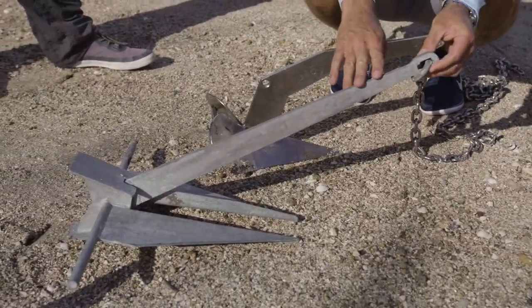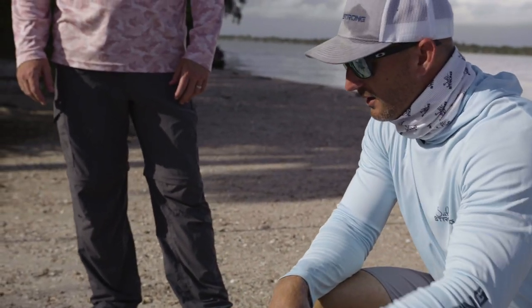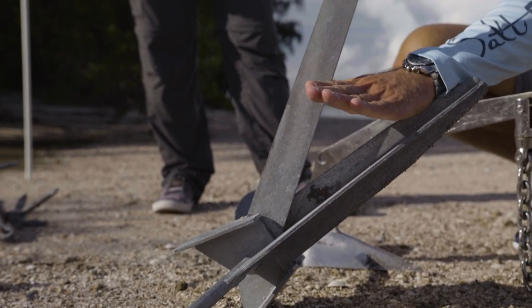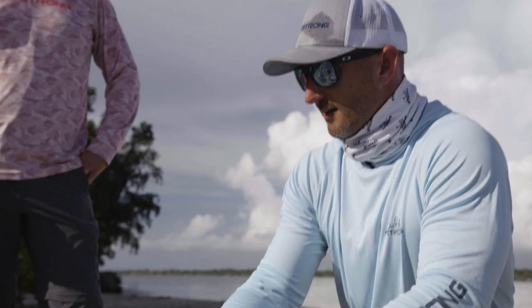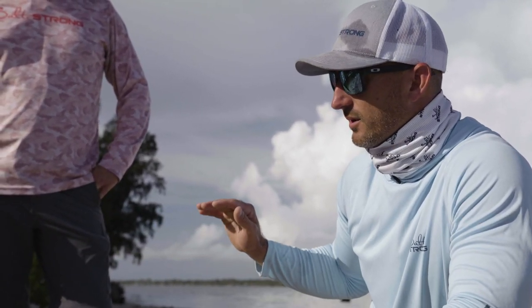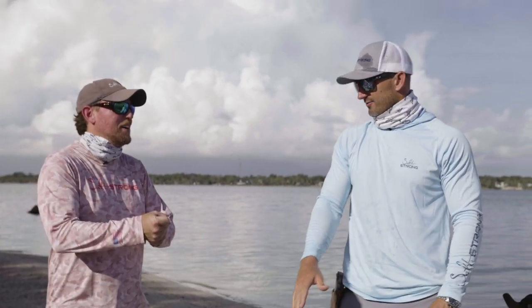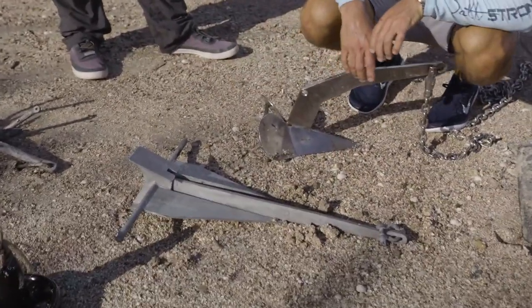The second best is a tie. First is a very large, heavy, well-made fluke anchor — this West Marine fluke anchor, made of galvanized steel. It works better than other fluke anchors because the angle of the flukes is larger, allowing it to grab more earth and rocks to stop the boat. In sand it did well, setting quickly. However, on hard sand or gravelly bottom, the flukes often wouldn't catch — it would lean over, drag, and sometimes never hold.